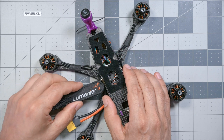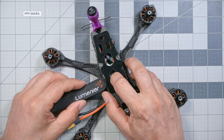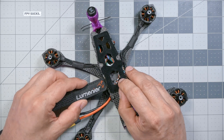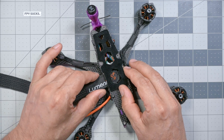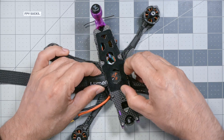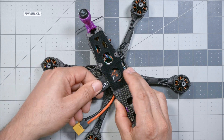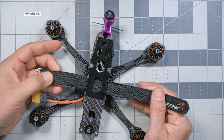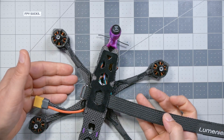What we're going to do is feed the battery strap through like this, and we're going to be very careful not to feed the battery strap underneath any of the wires. We've got this little wire here, and the battery strap needs to go above the wire, because when it's cinched down it's going to be pulling very tight and we don't want it pulling on the wire and breaking it. We're going to take the battery strap with the grippy side up and the Velcro side down, and pass that through like so.